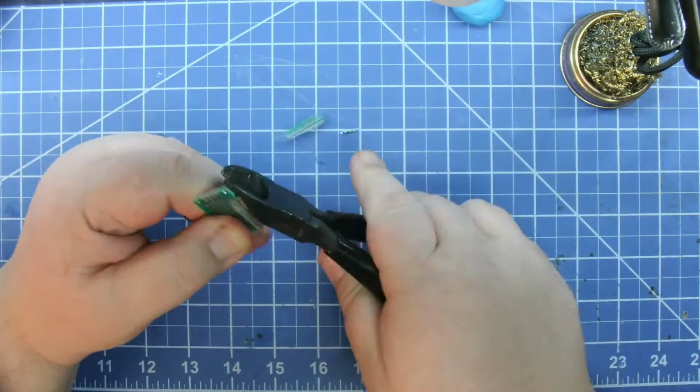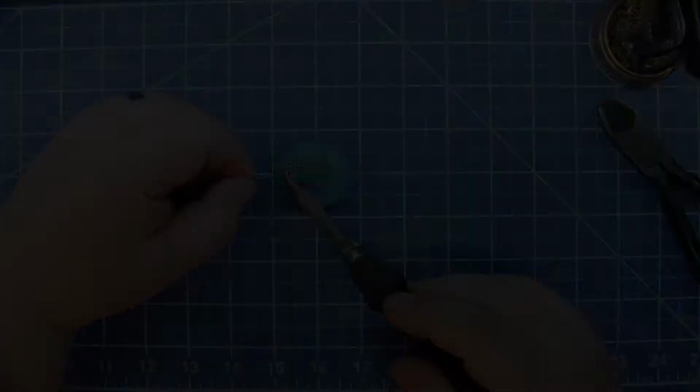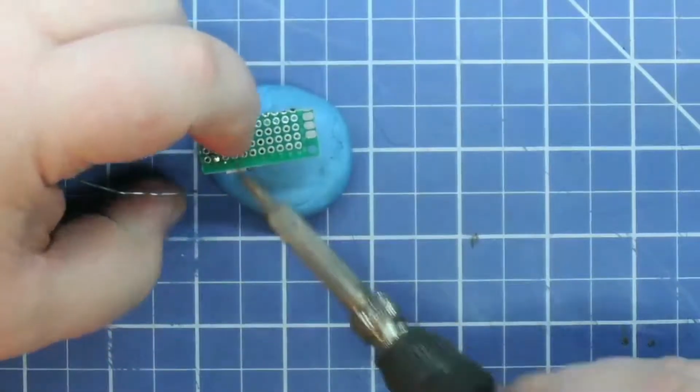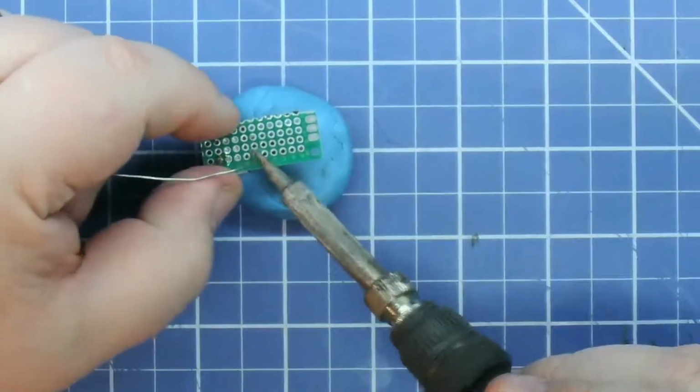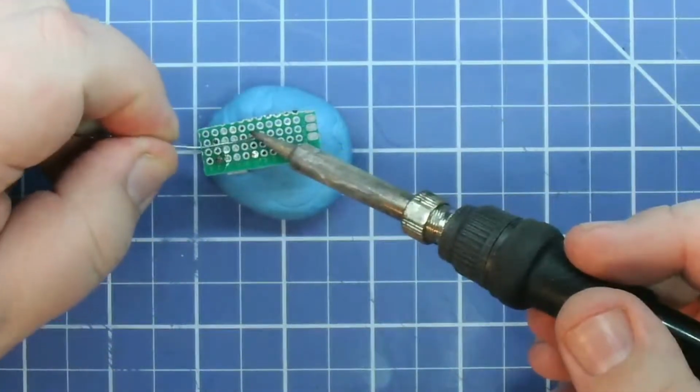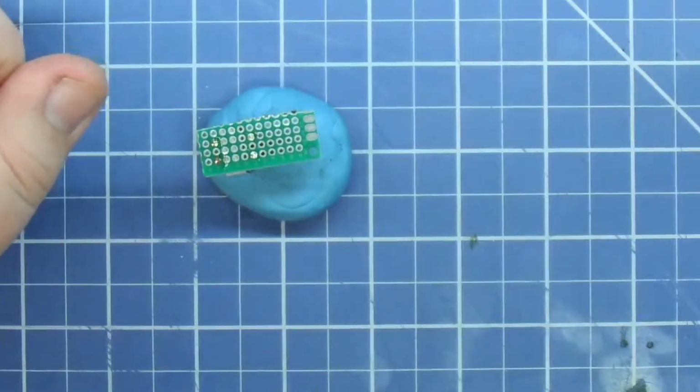There's a resistor voltage divider to drop the line out to mic level to protect the radio and the transformer. Then they use a capacitor to block the 7300's phantom 8-volt power from damaging anything, including the radio, because you don't want to basically short that out and blow out the radio. So that's what the capacitor is for.